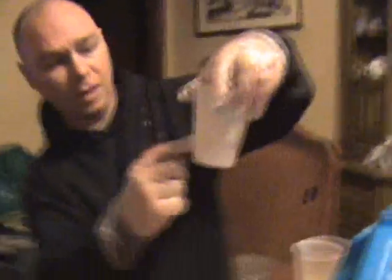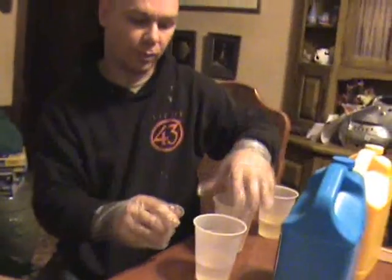I keep 3 cups for a reason. One, it's good to mark your lines. Two, you never want to mix. You want to save on cups. You want to save on the economy. So keep part B in one cup only, part A in one cup only while you're doing all your work. After all your work's done for the night, throw them away. But mix them both into one cup and constantly use that cup over and over again.